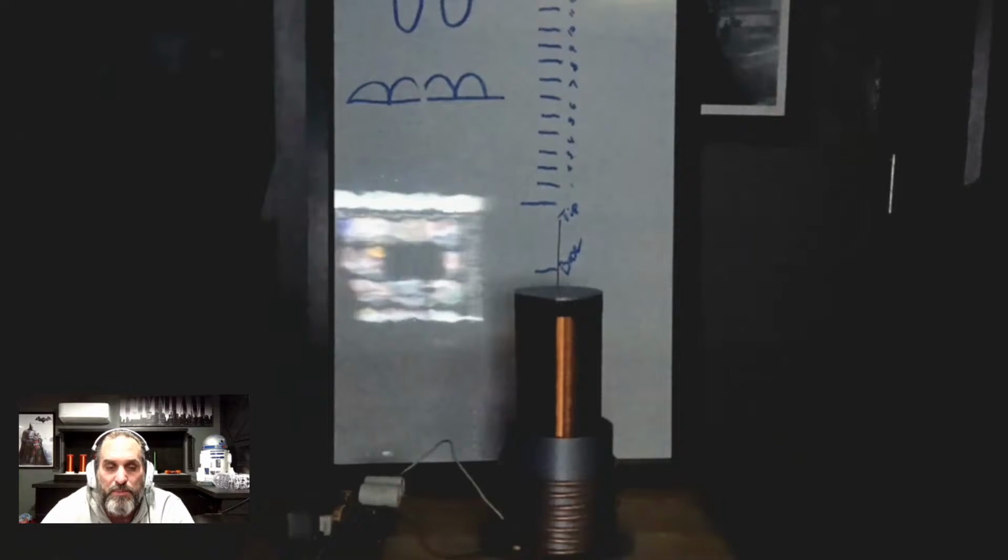And I could probably run it at 40 volts all day at that, because it'll cool it down enough for it to keep going. Is it recommended to do that? No. It's just a fun trick, man, and it came out with some awesome voltage. So, yeah, it really gets going. And the winding I put on this thing is perfect for the ZVS. Now, I said somewhere around 320, but when it's in resonance, it's more like 250 kilohertz. So, yeah, man, it's really rocking. So let's just show a little more plasma one more time.